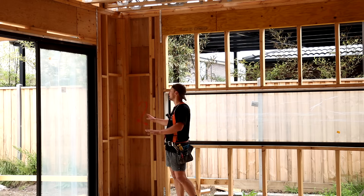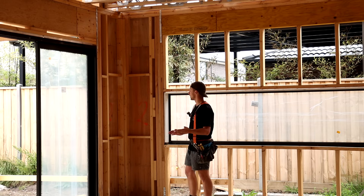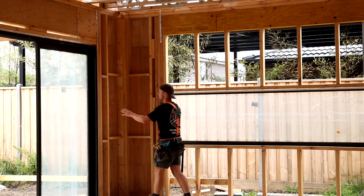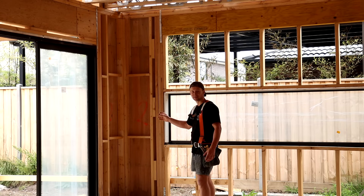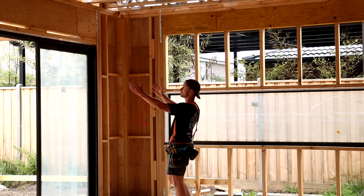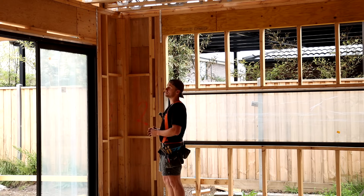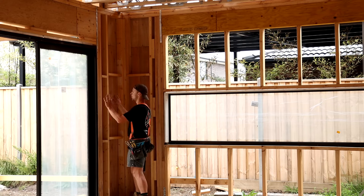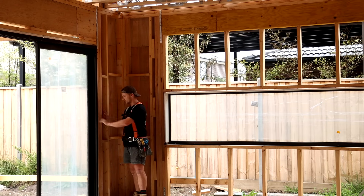There's a third type of timber you see a lot on work sites and both of these jam studs here are made out of it — these are called KD studs and KD stands for kiln dry. These are another really strong type of timber and you commonly see them at load points where there's a lot of weight coming down. For example, here we can see a monster LVL beam — a double 400mm wide LVL beam. It's holding a lot of weight above it and to hold that LVL beam and all the weight we've got a triple KD stud on the inside.